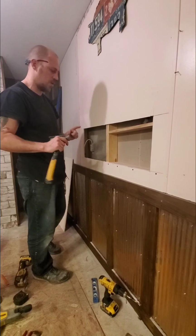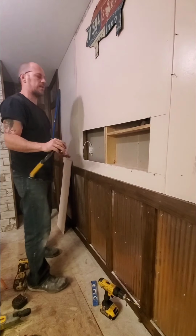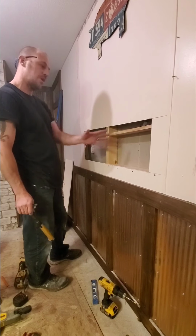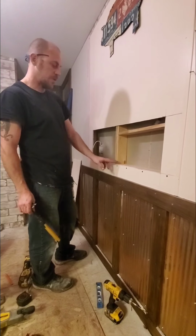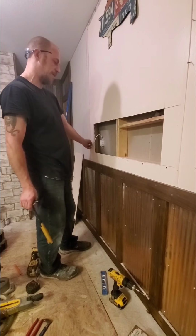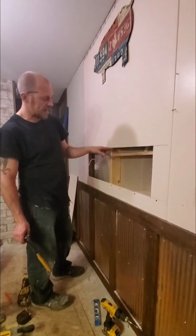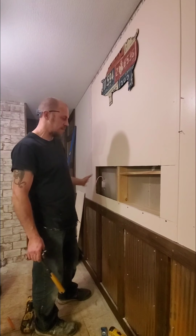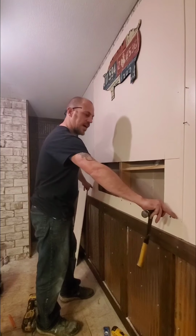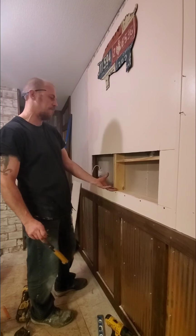Okay, so all we've done, now that we've got the wall open, we kind of figured out a few things. And let me point out a couple of things. Normally, what we would do to make this whole stretch go the distance is we would take 2x4s, and where the next 2x4 is in line over here, we would simply cut this guy high and low, get him out of the equation, and just rebuild our box, tying this back over to here, and then we would still have pressure points. That's how we would open that up.